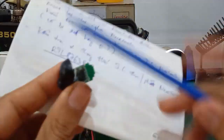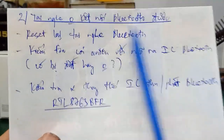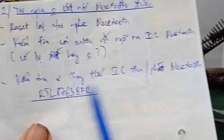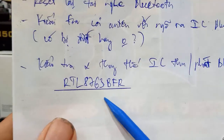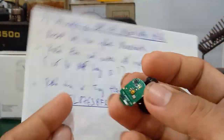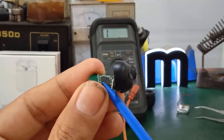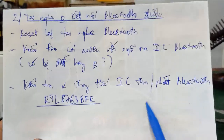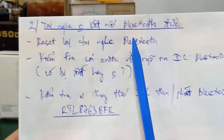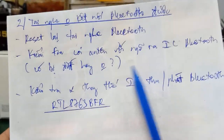It's not broken — good. So you've done a basic check: the output of the Bluetooth IC and the antenna connection are good. For cases where you've already reset the earphone and checked the antenna and it's not broken, then the only remaining issue is the Bluetooth transceiver IC itself. Remove this IC — the RTL8763BFR — and replace it. Different Bluetooth earphones use different Bluetooth ICs, but these Bluetooth ICs fail quite often. Check the IC number and replace it to fix the issue of lost signal or inability to connect to devices like tablets or phones.